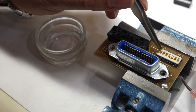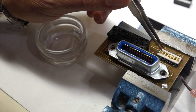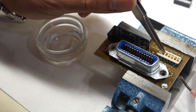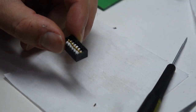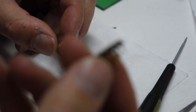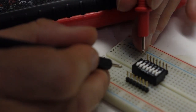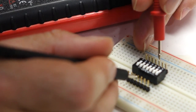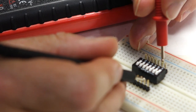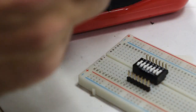The way this one is made is there are little rockers with little springs, and it pushes little gold balls around. You can see the ball is contaminated — it sticks all of them. So maybe if I clean that, I'll repair my DIP switch and save $0.50. Now they're super sticky. So can you put a DIP switch back together? DIP switch test coming up — I have repaired it.